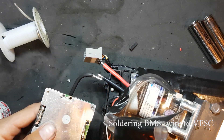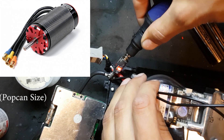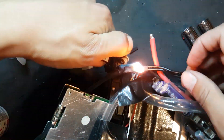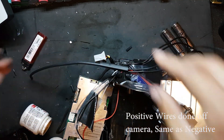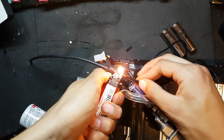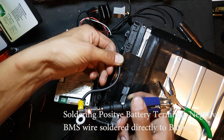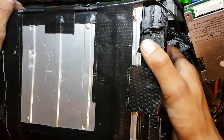Originally when I started this project, I began from my choice of motor. I used a Turnigy TrackStar T28 780KV motor. This was not a good choice, but it was what I had lying around. The recommended controller for the motor ran it at a peak of 7,000 watts. The problem with this motor was the winding — at 780KV, or 780 RPM per volt, the motor spins up to about 18,000 RPM. This is much too high for a skateboard, and under full speed I still only reach half the max RPM, so the motor has to apply more torque than otherwise required. To compensate, I used a very steep gear reduction, as steep as I could. Ideally, you would choose a motor around 280KV.